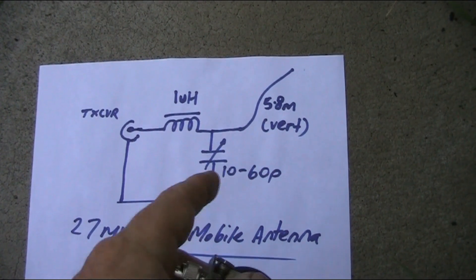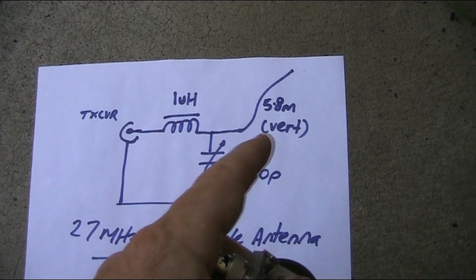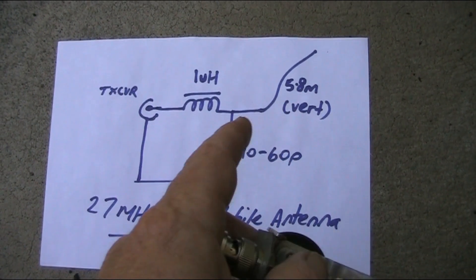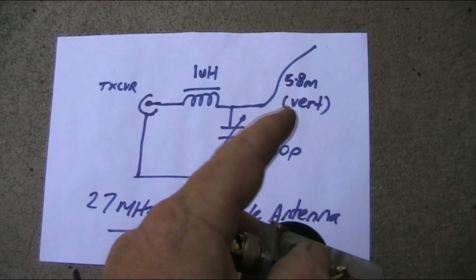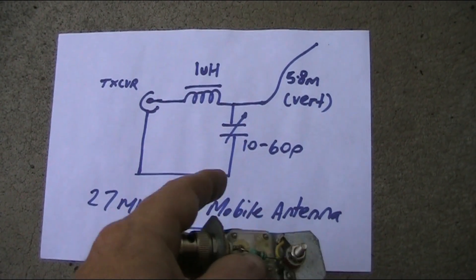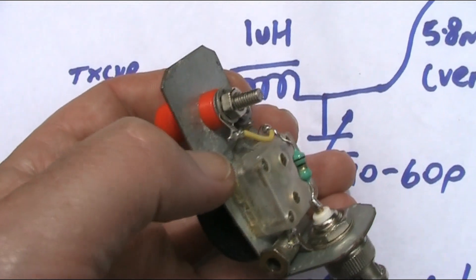If you're just interested in 27 megahertz, then use a low value section. These often have one section for 160 picofarad and one for say 60 picofarad — use that section only. I suggest not connecting the two sections in parallel because you want the minimum possible capacitance, as that's where your tuning range will be. The antenna is 5.8 meters of wire as a vertical. Any insulated wire would be okay provided it's not too heavy to collapse the mast. It's probably okay if it's 10 or 20 centimeters shorter or longer — the main thing is it's slightly longer than half a wavelength.